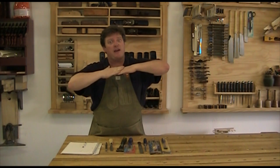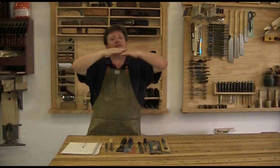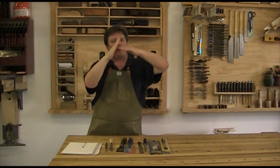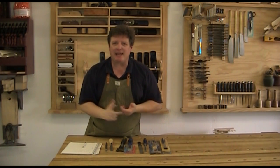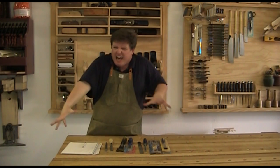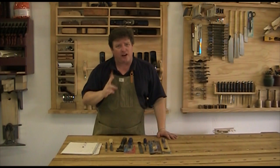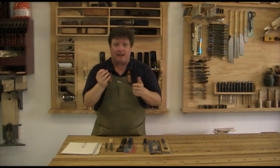So they become very, very hard. But they are very brittle also, because once those two straight contact points separate, there's very little holding them together, so then they break apart. And that's where that steel is after it's been quenched in that water. That thermal shock seizes it up. That right there does not make a very good chisel. That right there is the state a file is in.